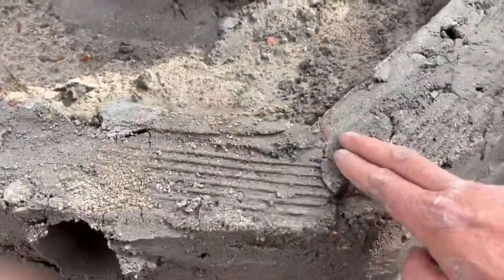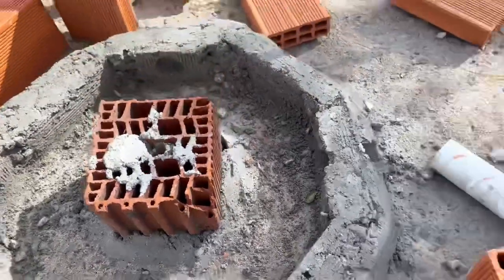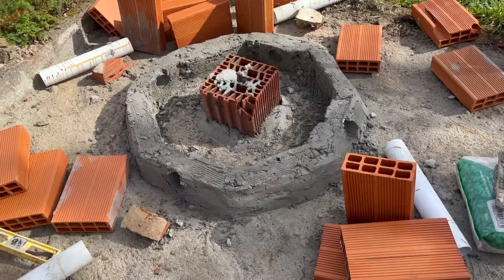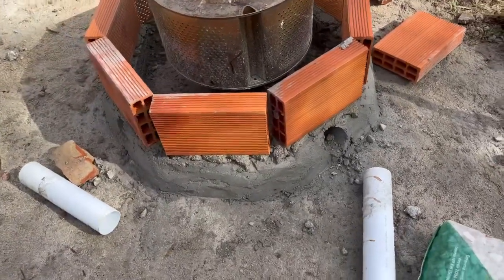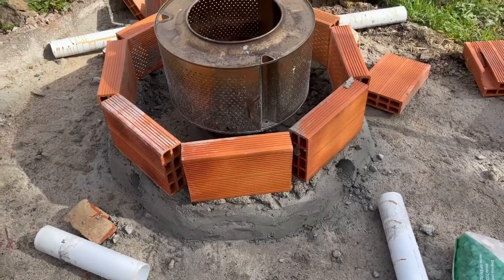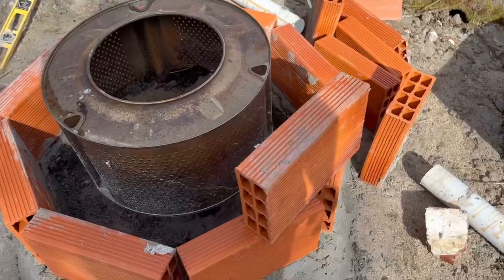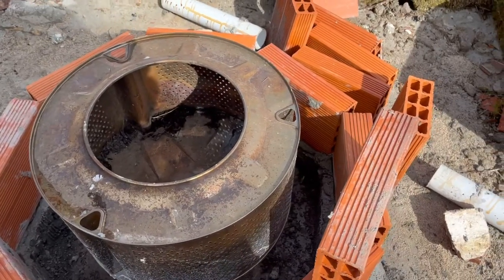Overnight the concrete set rock hard, so that should be a great base to start with. Just mixed up the cement mortar mix and I'm going to put it around the first layer — two layers of these bricks all the way around. Got the first layer all roughly laid in, going around with a trowel to smooth over and fill in the corners. For the next level I'm going to go the other way around so they support each other and make a tighter gap at the top.